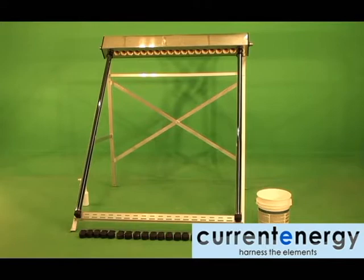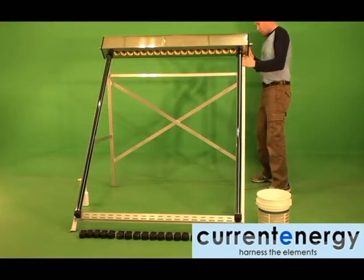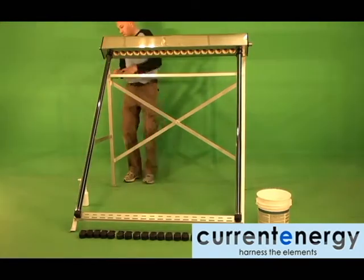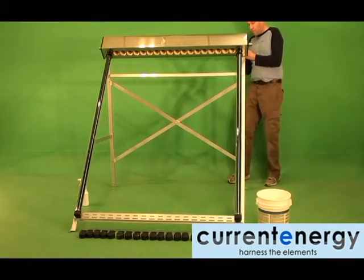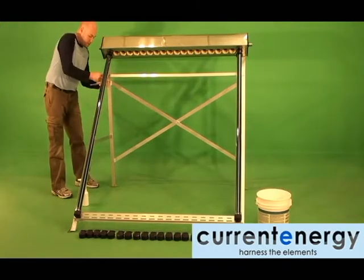When you are inserting the tubes, you should insert one on either end of the collector before any others to ensure the system is squared up. When satisfied, proceed to tighten the nuts and bolts of the manifold to hold it firmly into place. You can tell the system is square when the gap between the manifold and the tube at the manifold openings is equidistant along the whole of the circumference.